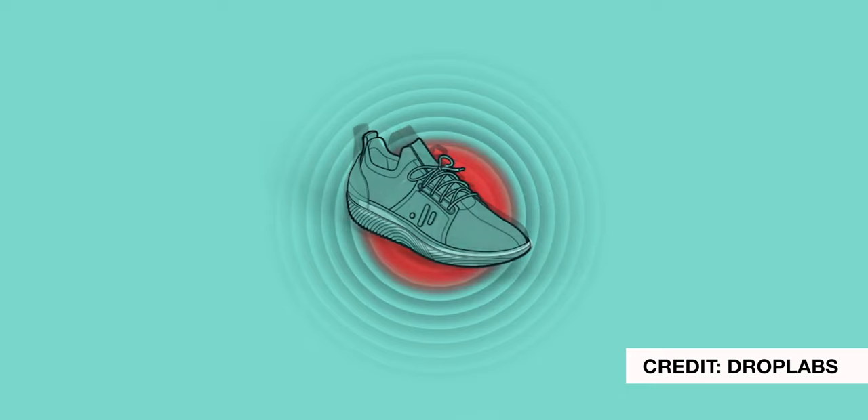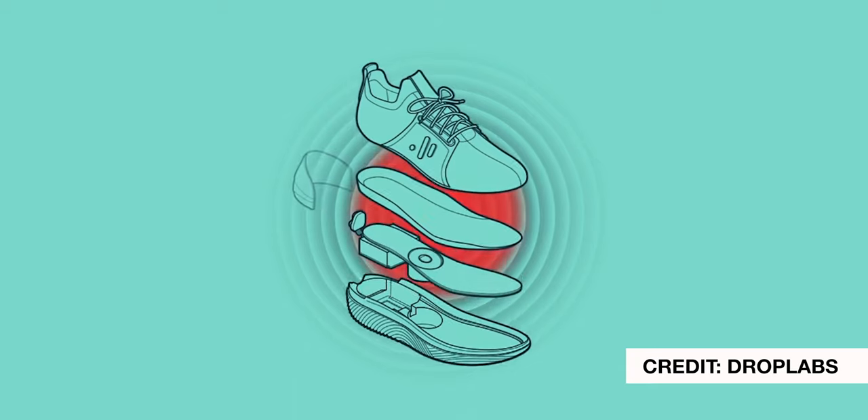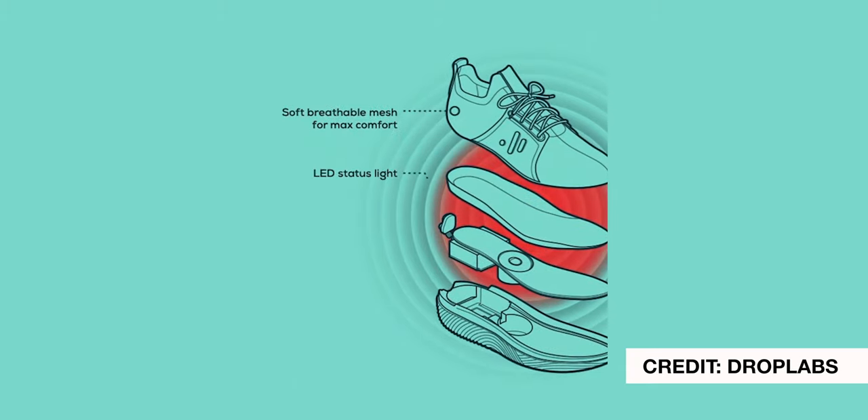What is it exactly that makes the haptic feedback that comes from these shoes — is it like a subwoofer or something else? It's similar to a subwoofer. Basically there's a small amplifier and a transducer inside the shoe. It's constructed almost like you would construct a subwoofer, but instead of having a speaker cone where sound gets transmitted, we send that energy into a foot plate in the shoe. So it's built like a speaker all the way until the point where it normally makes sound, and instead of making sound, we're sending that energy into this foot plate that has a little bit of a range of motion, similar to the floorboard we were talking about. And that runs on the bottom of your foot, so you feel that energy in your feet and up into your body.